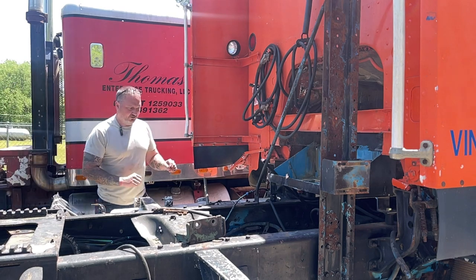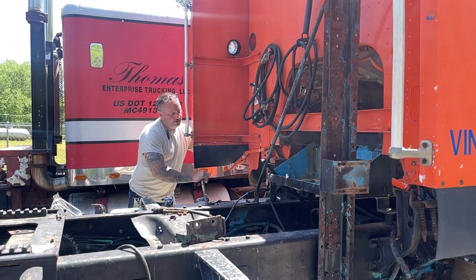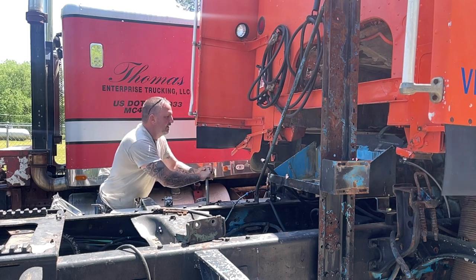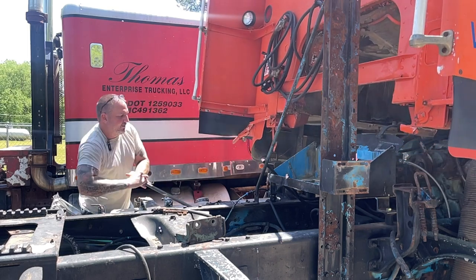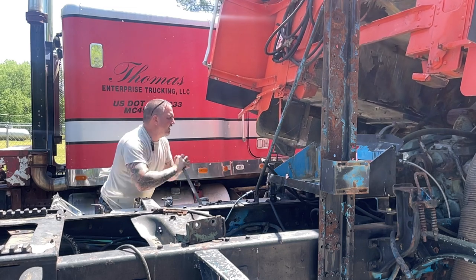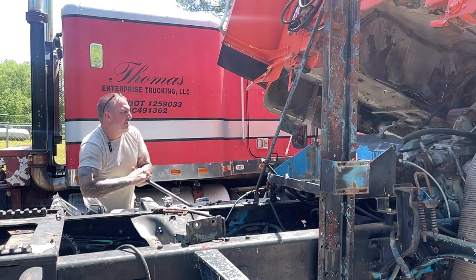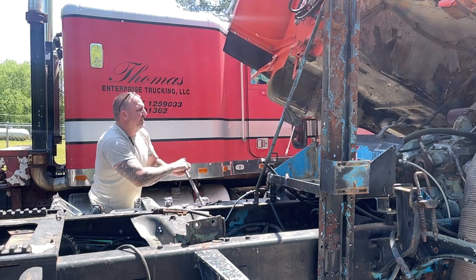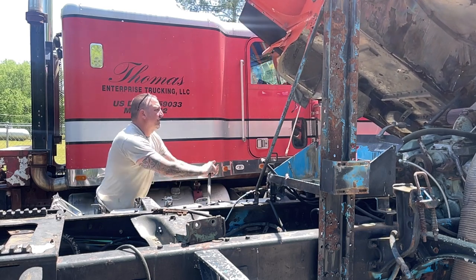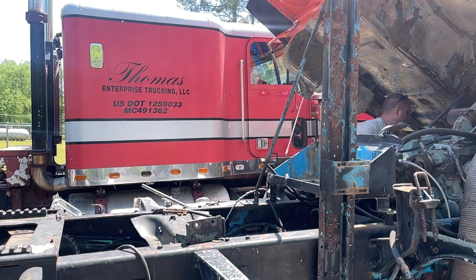One thing I like about this truck is the cab jack works really well. The Freightliners have a dual motion jack. Up, back and forth is up. So not just a one-way pump, but a two-way pump. So we'll go ahead and get this cab jacked up, which will give it a chance for all the water that's inside to run out the weep holes in the front. We'll get it up on the safety catch. We'll get in there and get the mount reinstalled. And we'll kill any of these striped wasps that we run into. Yeah, I really enjoy the way this thing jacks up.